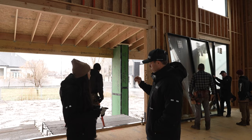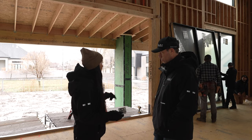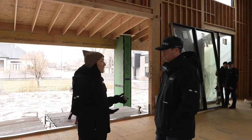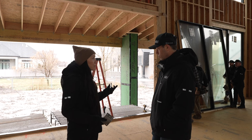Talk me through the next step in prep before this window goes in. We've got our channel routed out, we're taped up, the guys have measured everything, and we're good to go. They're going to go through and start putting silicone on the opening to make sure it's watertight. Even though we have a covered patio outside, 10 or 20 years down the road if someone remodels, we want to make sure this house is completely watertight. The guys are putting silicone on the opening, then they'll bring in the first piece and make sure it's in the right spot before we join them together.